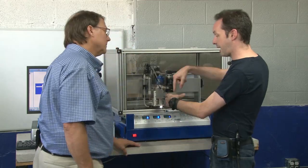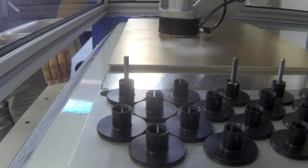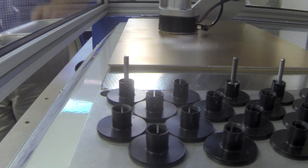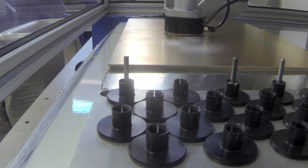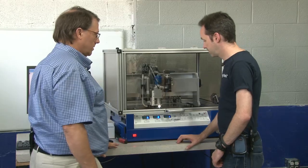With this cutting, it brings down the shroud and the tool, and I know that it's a combination of that for when it measures the offset. Can this detect if the cutter breaks? It cannot. What it can do is, at the end of the run, go back to the target position and test to see if the tool is the same length that it started with. And if it isn't, it can throw an error at the end of the job. But while it's running, it's not testing to determine the tool.